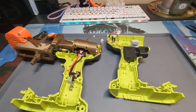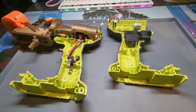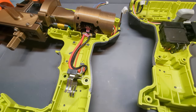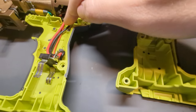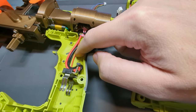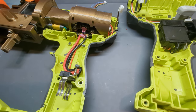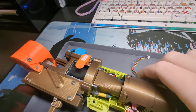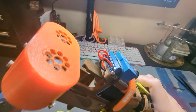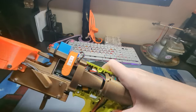So, stock battery contacts. I've got 16 gauge going to the 4-in-1 ESC, and another set of 22 gauge that's powering the relay for the solenoid. That 22 gauge pops out of the front there, and it is relayed to the solenoid when it's turned on.